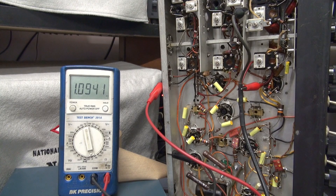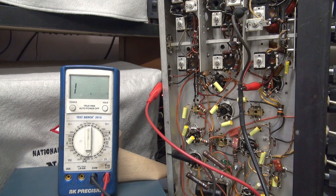In the first test, we'll check the antenna input coils. Connect an ohmmeter to terminal A1 and chassis on the antenna strip. We're going to start at band 1. As you can see, we have 1000 ohms on that input coil. That's because they have an attenuation resistor R65. Let's check the other bands — bands 2 through 4 are going to measure under 1 ohm.